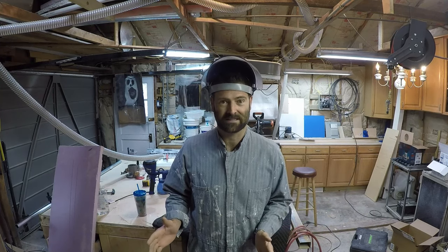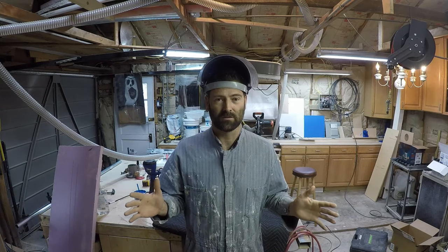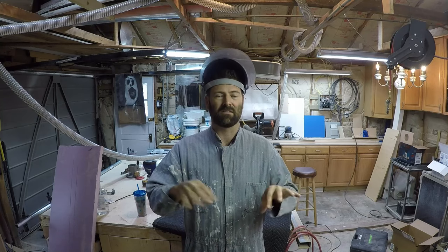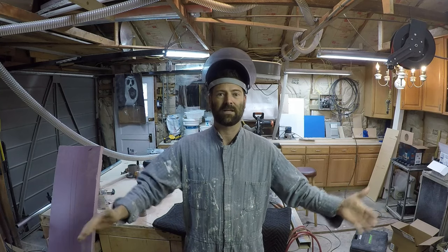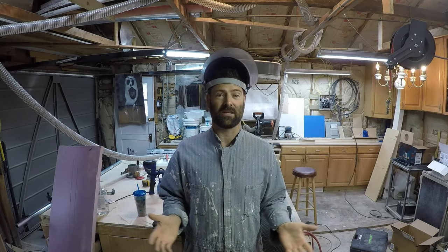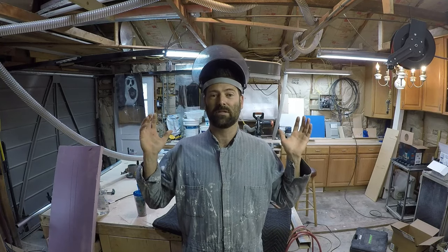Apparently I read too many YouTube comments and just know what to say and what not to say on the internet. The chemists of the world say spraying bleach on mold is useless. It doesn't kill the spores. It makes it look like you killed the mold, but it doesn't kill the spores that live in the wood and things like that. If you spray it on a solid surface, like a countertop, it'll clean that off. But if the material that the mold is on is porous, bleach just doesn't do anything. And if you're caught doing it, the keyboard commandos go absolutely crazy in the comments and say all sorts of nasty things about you.